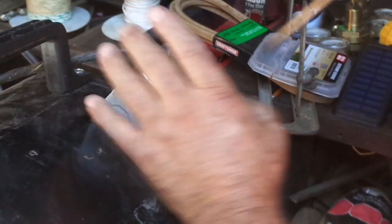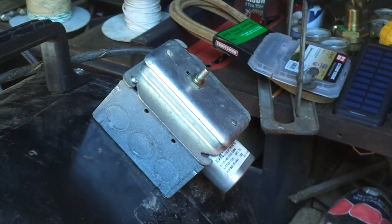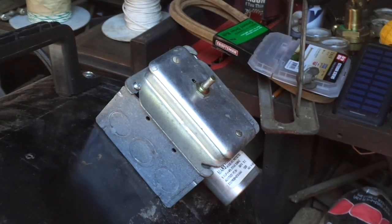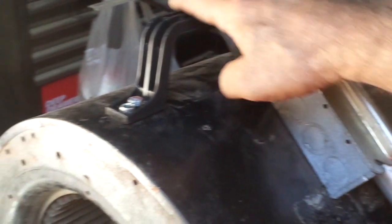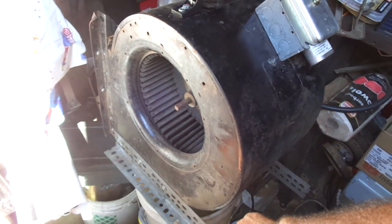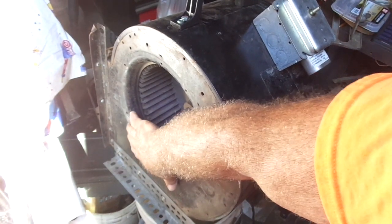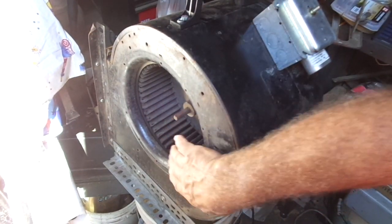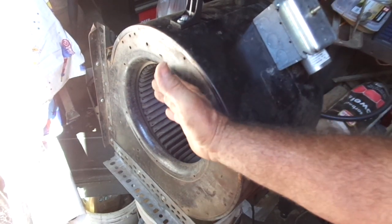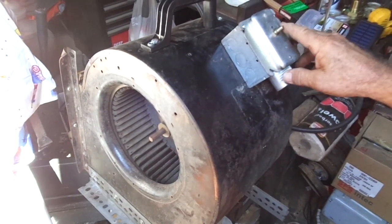Now this is a rotary switch — actually an aircraft rotary switch; that's got its own story. Once we make sure nothing's going to come in contact with it when we turn the power on, we can set the whole assembly back together and tighten it down. What you can do with these multi-speed internal blowers is install a rotary switch and successfully wire them for multiple speeds in your workshop. I used an old handle off a six-foot patio door delivery, some scrap iron — unistrut or dexion, the angled perforated plate. You have to limit the airflow by dampering or blocking the discharge — I prefer to block the inlet — then put your amp meter on it and throttle the air to get your amp draw under the full load amp rating of the motor.